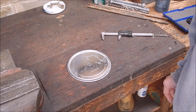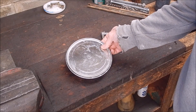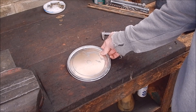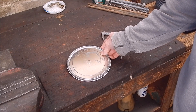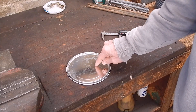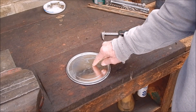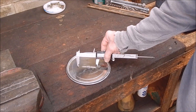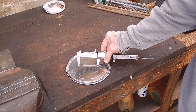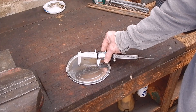While the cement and perlite mix is hardening, I might as well get on with the lid to keep the heat in. I'm just going to use a paint tin lid for now and see how it goes. The perlite mix is out on the back of the ute in the sun - probably take a couple of days to harden. Now, I've had comments that the vent hole in the lid should be two to three times the diameter of the burner hole. The burner hole is 32mm, so 64mm is quite a big hole. I'll go twice as big for now - we can always go bigger if it doesn't work properly.